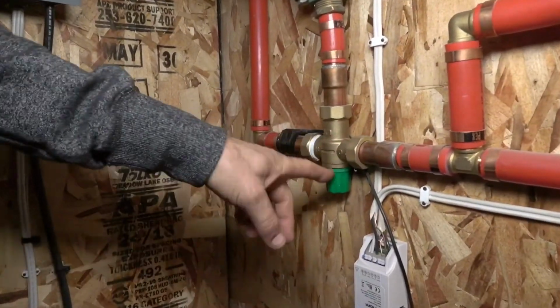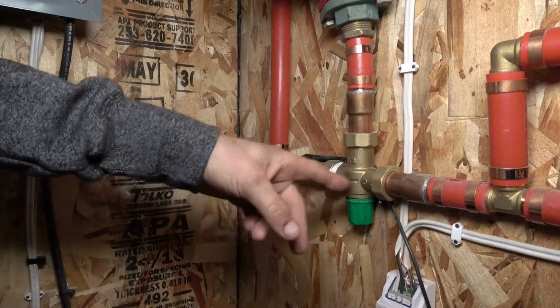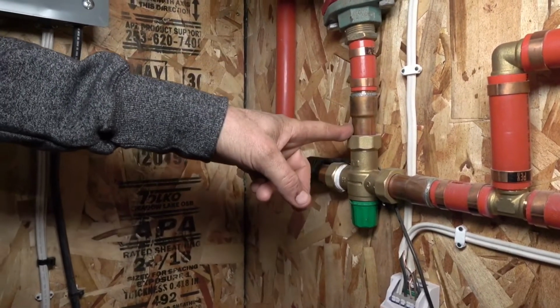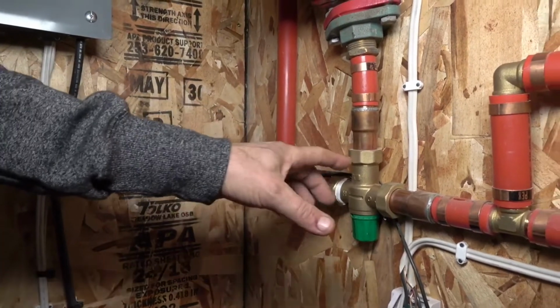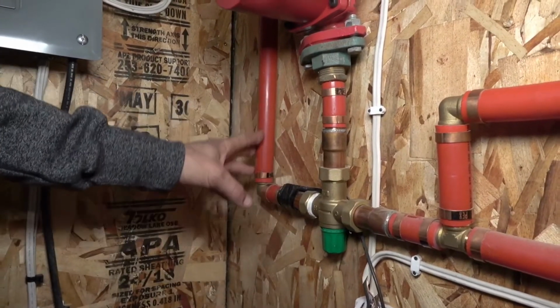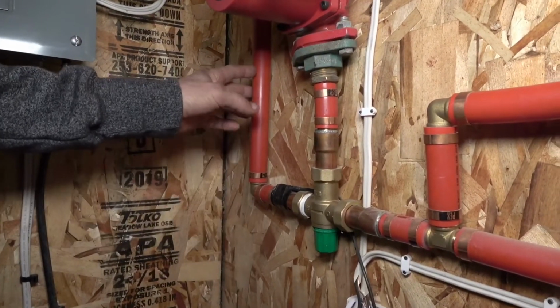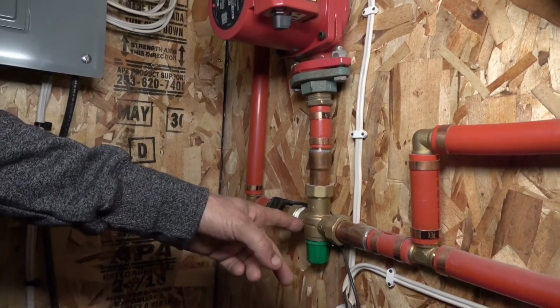But now I have a mixing valve here, so I can control the amount of hot water coming through, because you don't want to go more than 120 Fahrenheit into a radiant cement floor, because it could crack or whatever. But generally, I've got a lot of loss with the 60, 80 feet coming into the house that it's cooling it down enough that I just have this full-on heat.